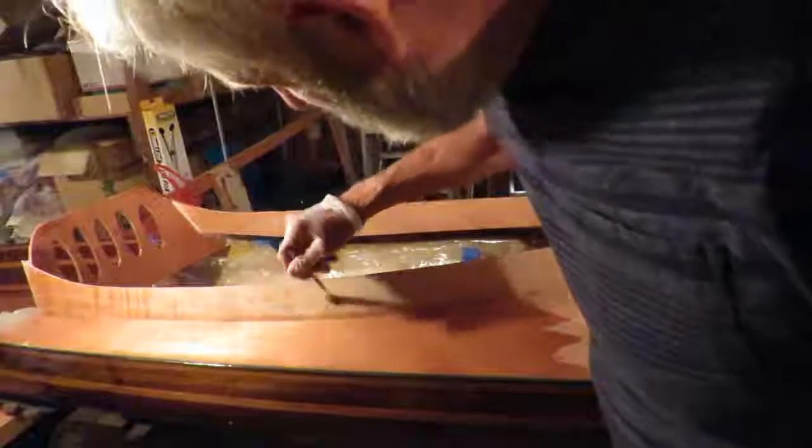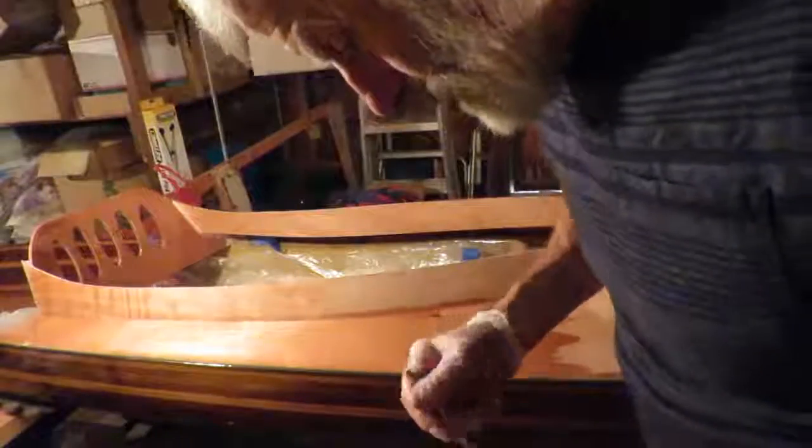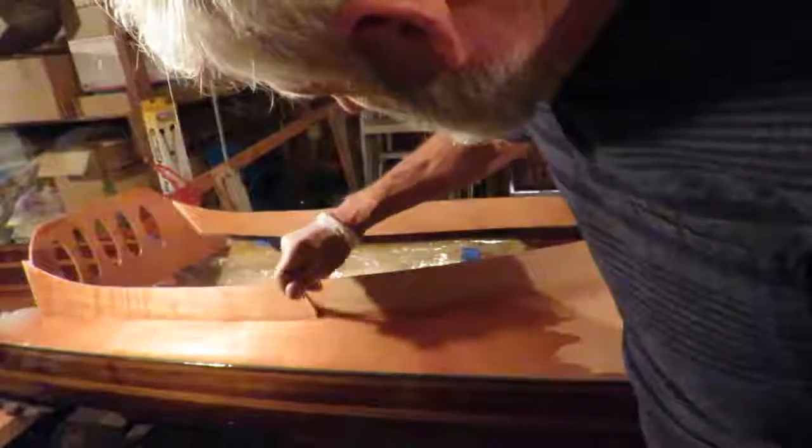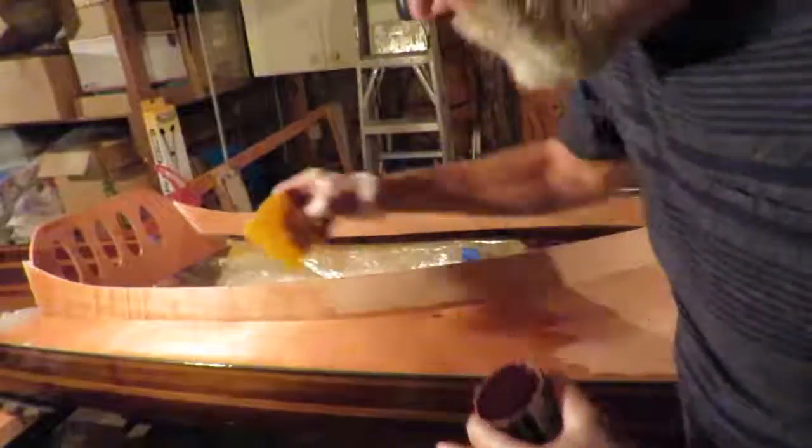See if we have a little bit more here. When you place it, brush it out a little bit, and then when you squeegee it, you're going to find you have a lot more coverage than what you can get with the brush. Make sure you don't leave any dry spots. You don't want to do that. The color won't blend. Then squeegee it out, and you get almost twice the coverage. So we're way up here with the squeegeeing out here.